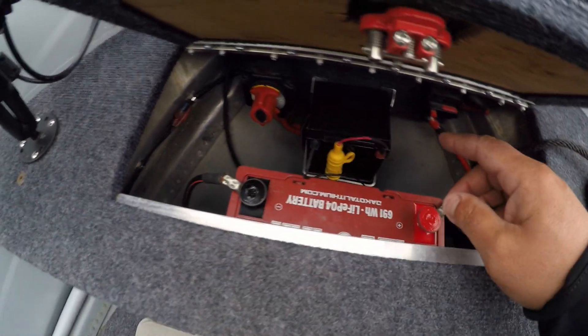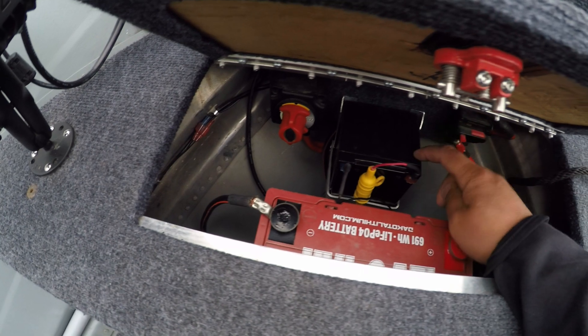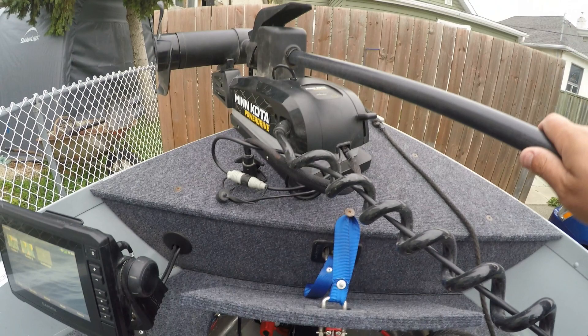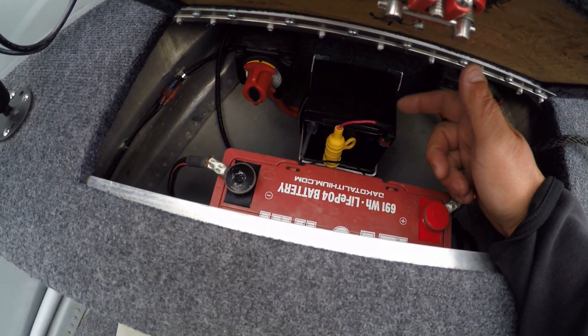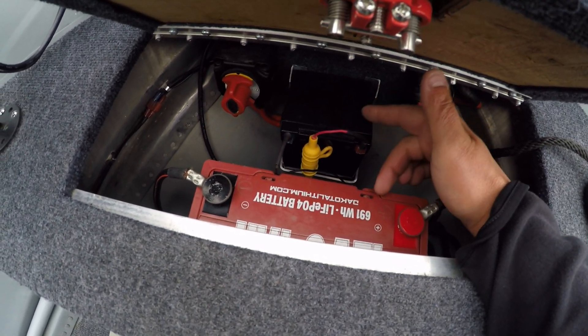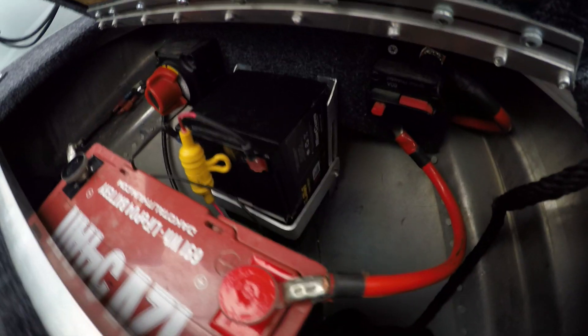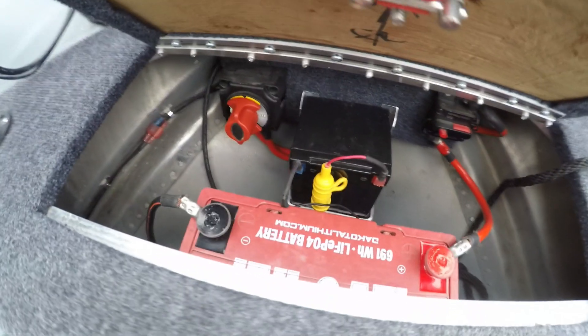The reason I have two separate batteries — the 54 amp-hour Dakota and the 18 amp-hour Markham — is that every so often with the trolling motor running you'd get some weird static signal when they're connected together. So I decided to run them separately. In the new boat I'll figure out how to do it a little differently, but that's the reason for this setup.